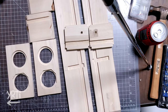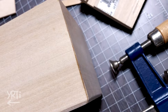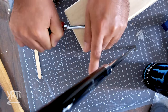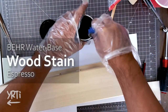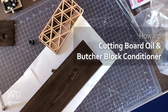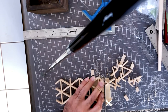These are all the pieces I fabricated, and it's time to glue them together. I'll let them dry overnight. As I expected, the miter joints weren't good, so I'm trying a technique I just learned from YouTube: put glue in the gap, burnish it with a screwdriver, and then sand it. It worked! So I can put the stain and oil on. I trimmed the kumiko pieces to finish while waiting for the stain to dry.